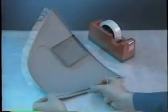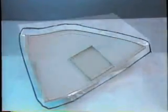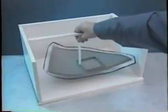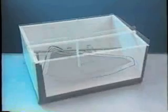Tape is placed on the master and coloured to form a split line that will be visible through the silicon rubber. The master is then suspended in a casting frame and rods inserted to form the gate and provide venting during casting.